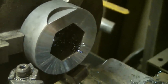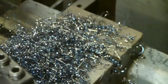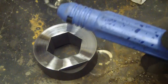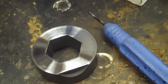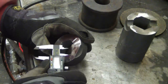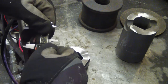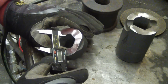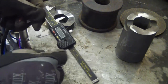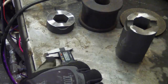There we have it — a beautiful face on a press die, considering we started out with a gnarly zip-cut face and had to take off about a quarter inch. I want to deburr it a little bit but the deburring tool won't even touch it, so I'm going to hit it with the emery cloth. Not quite sure how big this even is, so let's measure it — that's over an inch. In metric, 30 millimeters — 30 and a half — that's pretty big. I've got these cheapo four-inch calipers from Harbor Freight; they're a pain because there's no thumb wheel.